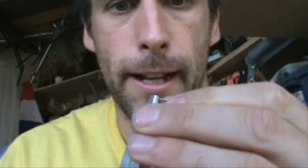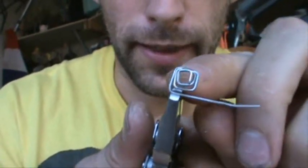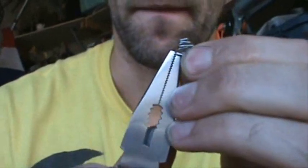This will take care of the other battery contact over there. I foolishly used my entire paper clip on one end, so I had to find another one. This kind I'll have to rip the plastic off — plastic is not such a good conductor of electricity. I'll make the same spring as before. This time instead of bending stuff way over, you're gonna put a piece right behind that goes into a hole, so I'll bend that back there and up like that.